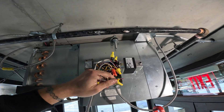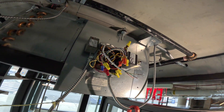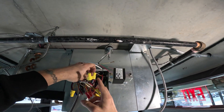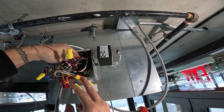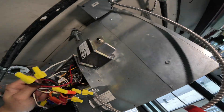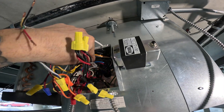So this has gotta be the thermostat cable. Let's strip these back. On the transformer it says common is yellow and the 24-volt hot is yellow and white. Coming out of the transformer — where are the wires? Is this yellow and white? That's just white, goes nowhere. So yellow — somebody screwed these people and cut the wires. I don't see a yellow, where is it?